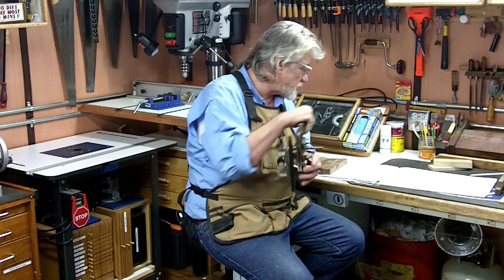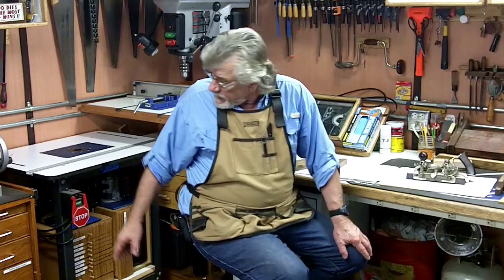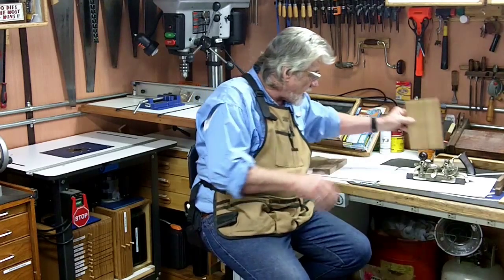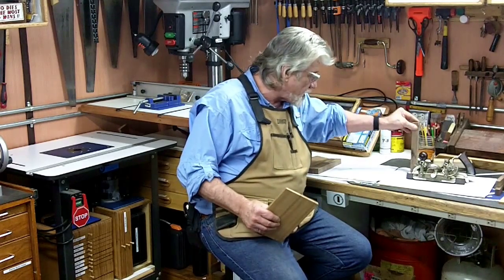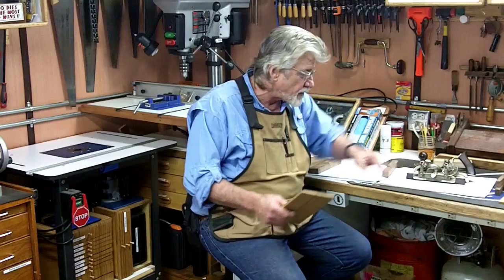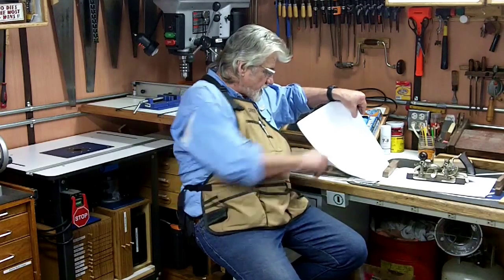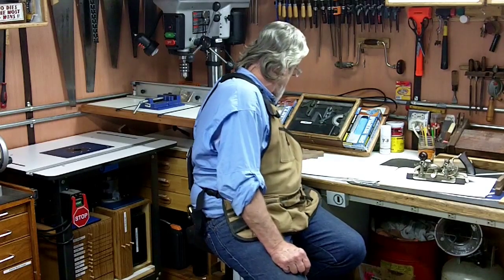So I'm going to build a display case. What I'm building it out of is some walnut that I had, some 8/4 stock walnut. And then I had some bamboo left over from the drawers on my saw blade containers, so I re-sawed that down. I'm gonna have panels, and I'm gonna have columns, stiles, and rails for this display case with a plexiglass front. I've got kind of a little idea on what it's gonna look like, but that's not saying it's going to look like that. I may change it quite a bit.